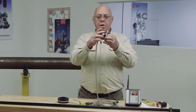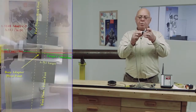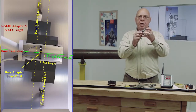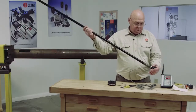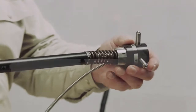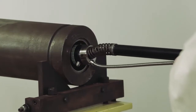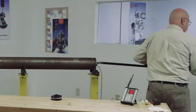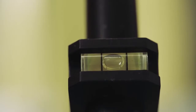These legs are a little bigger than the bore itself, so when I put it in it's going to be at an angle. But the legs are offset, and right here in the middle where this pivots — that's our measuring plane. This can change its angle all day long and it's always going to stay self-centered. Then we'll put the handle on the target; that just screws on. When we put this in the bore, we gently pull back on the cable so it tilts down, fits in the bore, and release it — it locks itself in and is self-centered. There's a level on the end of the pole, so when the cable is on the bottom, make this level from side to side.